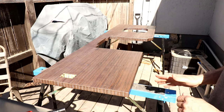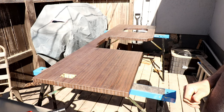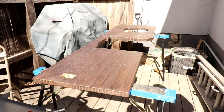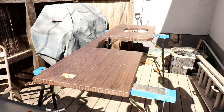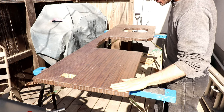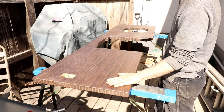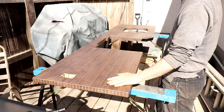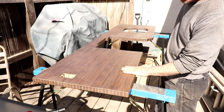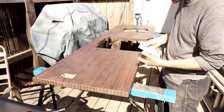Make sure it is completely dry, because like I said, I'm going to sand it down before applying the third and final coat. So hang tight. It's been about half an hour, so let's give this thing a little sanding. The reason I'm sanding it is to get rid of any slight imperfections that might still be on here. It feels smooth, but I do feel the occasional bump. Yes, I know I'm putting an epoxy on, but still, I don't know. Just seems like the right thing to do.